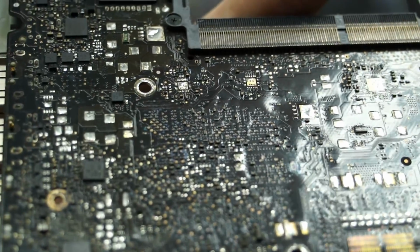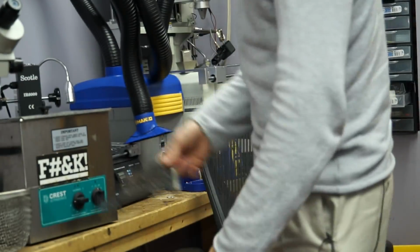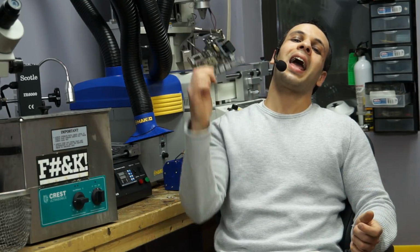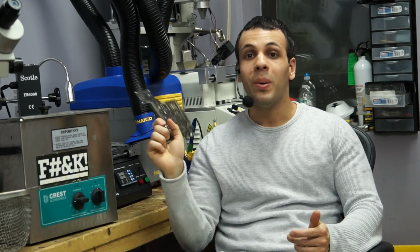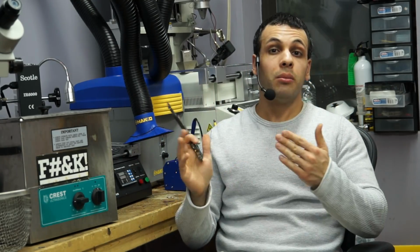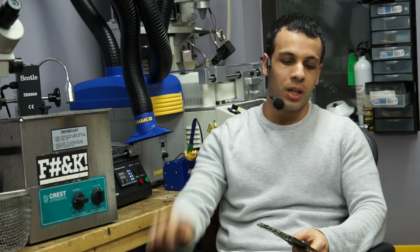Look at this. And again, this stuff was not like this during the original liquid spill. I've done enough of these boards. I've gotten enough of these in from retail customers to know that this is not how they started. This is what they did to them when they put them in these cleaners, either cheap cleaners that wrecked the board, or even worse, good cleaners where they just kept the board in there for an hour, or they just didn't dilute the liquid they put in.